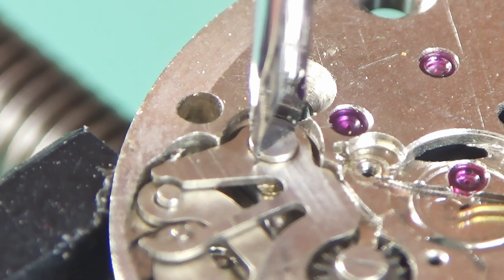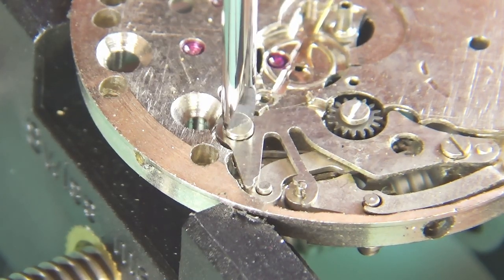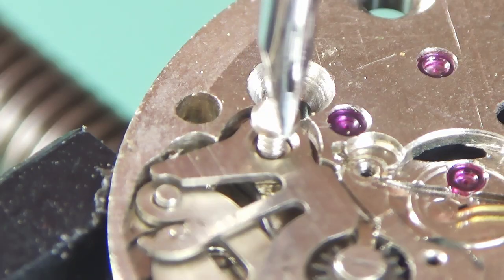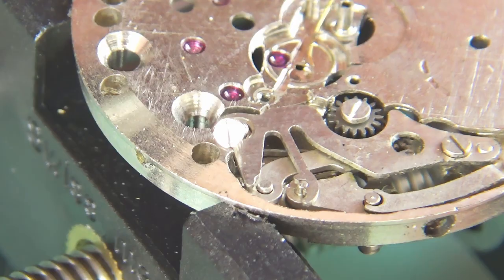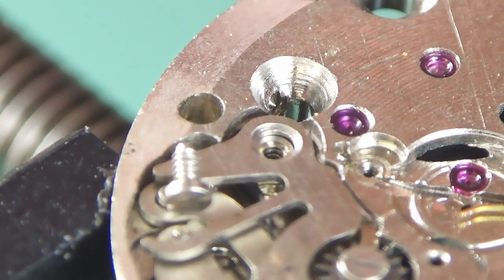And that's connected to the other side of the watch via that friction pinion on the second wheel. So, disassemble the keyless works here. I wasn't really expecting any surprises. Very rarely is. Keyless works in a watch this age have been very well established. There's a way to do it.